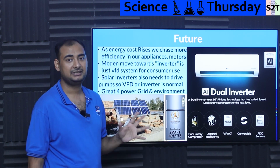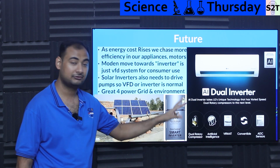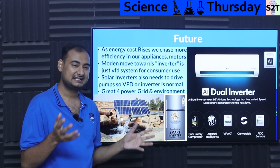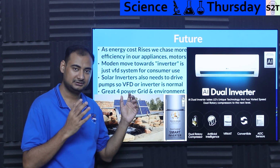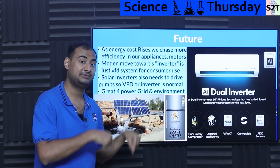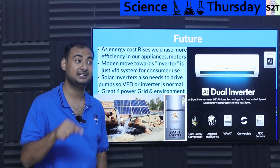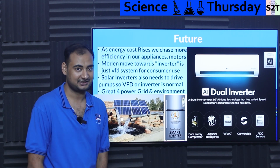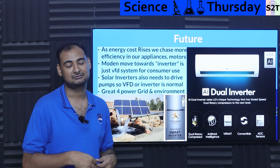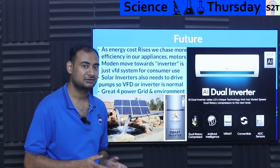So this is a very good growth, and be mindful, this is good for everybody. Not only do you benefit from having less load and less electrical consumption, the national grid also benefits. Why? Because there is no more surge, and they had to pay for the surge. They had to reinforce the cables. That's why commercial users have to pay for the power factor. Power factor is not magic. We do not have superconductors, so it does turn into wasted energy. You do not want to waste energy.